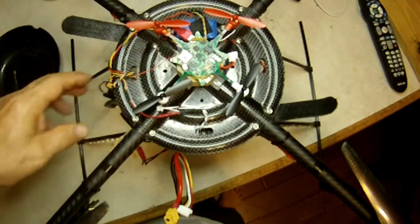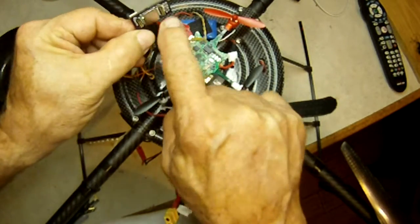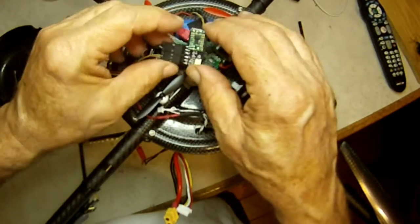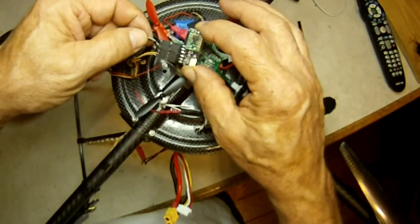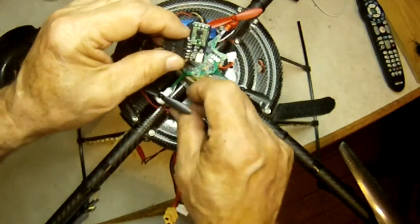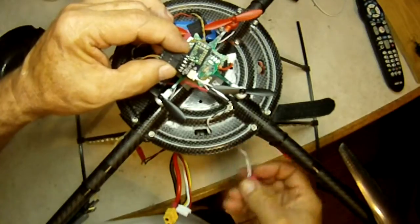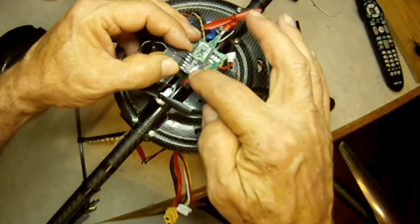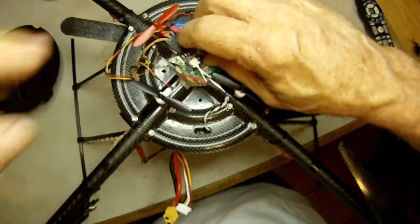Works great. Okay. Now the next thing to plug in is the expansion board. On the expansion board, we've got connections through two 10-pin connectors to the signals that are on the board available to us, and we have four PWM signals which are going to come out here, two of which are going to control the lights, and the other, the ground and the other wires, is our tilt signal down to our gimbal. Okay. And we're also going to hook up a Bluetooth adapter here, which is sitting down here on the side. And this is a little Pololu step-up converter, 3.3 volts, that provides power to this connector. And it has transmit and receive to talk to the Bluetooth modem.